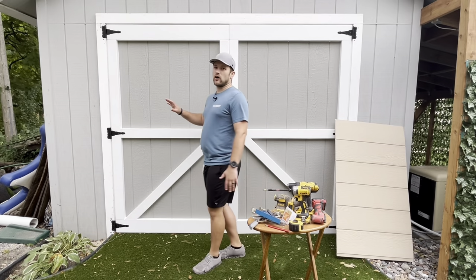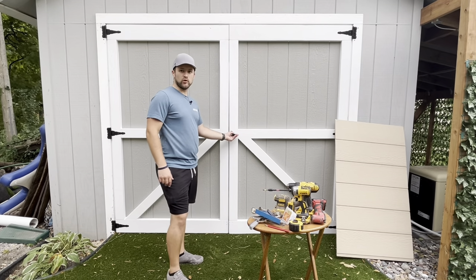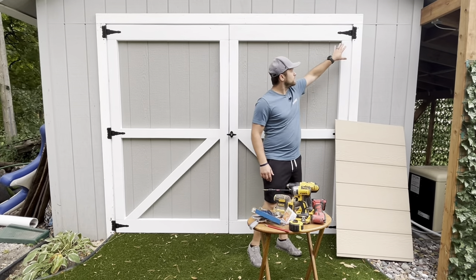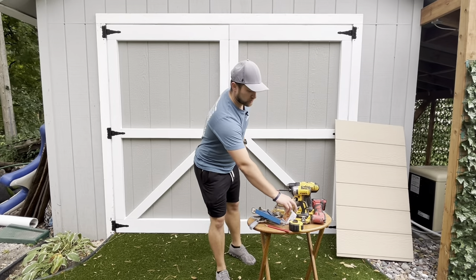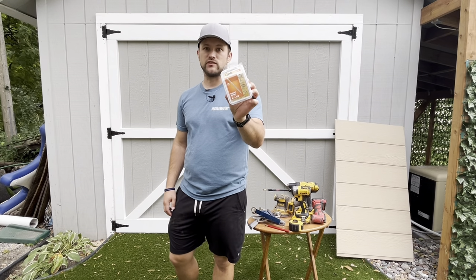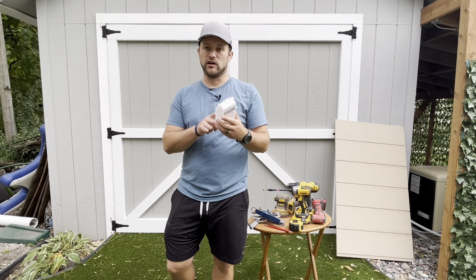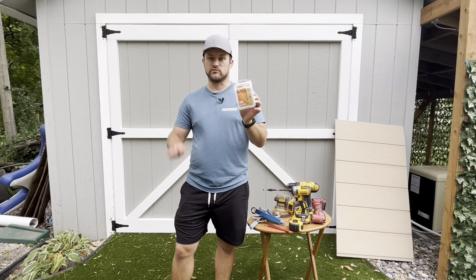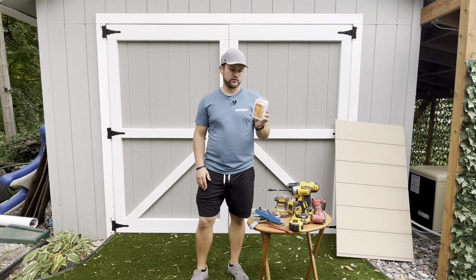You're also going to need hardware. I did black matching hardware. This is a shed door latch I got off Amazon — I'll post a link in the description. I also bought at Home Depot 6 matching hinges with a pretty good weight rating because this treated lumber is heavy. I also used GRK fasteners. I really enjoy working with these — they're technically cabinet screws but treated for outdoor use and treated lumber-approved. They have a really high weight rating in terms of snapping power, they hold strong, and they go in really easy. Overall a really nice product.